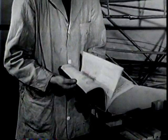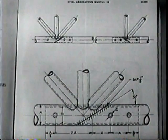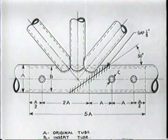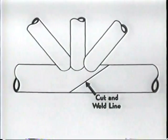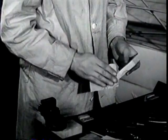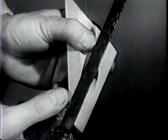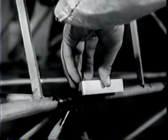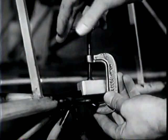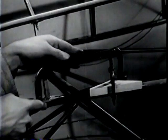But what about the details? First, what does the manual have to say? You'll find that it has complete specifications for replacing tubing — there are several methods. The drawing for this type of job shows where the tube should be cut and welded in relation to the cluster weld. It also shows that the cut should be made on an angle of 30 degrees with the longeron. The first job is to cut the damaged section on a 30-degree angle. You'll find this easy if you'll prepare a block with 30-degree angles and clamp it to the longeron so one side of the block is along the place you want to cut.